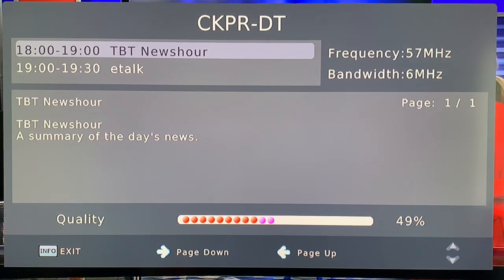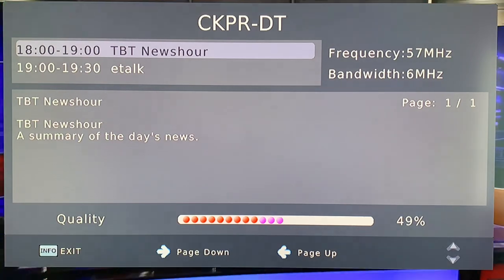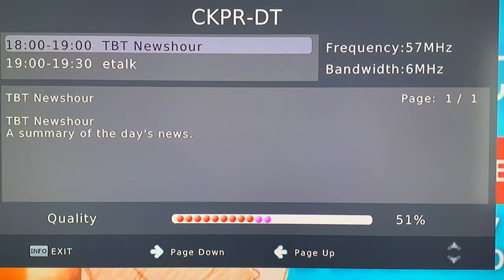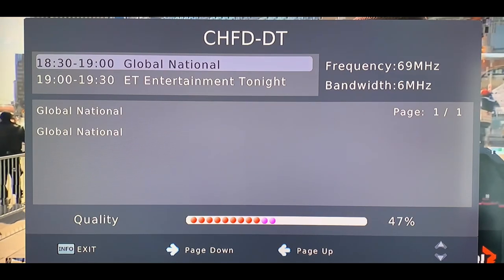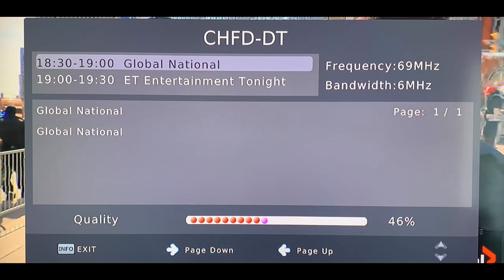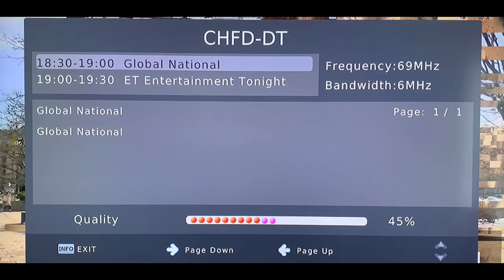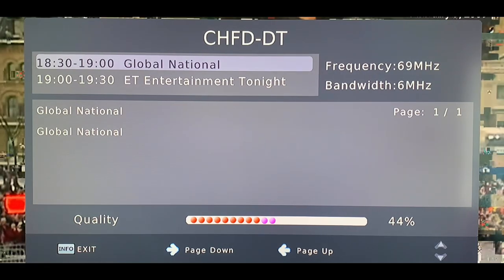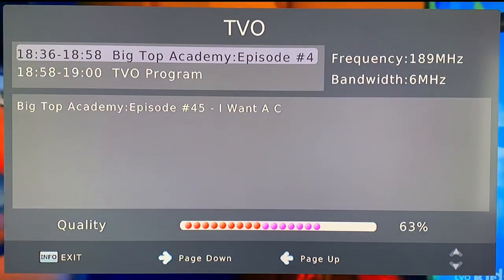RF channel 2 is actually doing pretty well with a smaller indoor antenna like this — the picture is stable, no glitching, no pixelation, and it's hovering right around 50, which is really good for VHF channel 2. Channel 4, though, this is definitely not a sweet spot — it's a glitchy channel and really tough to pick up inside reliably unless you're using a larger antenna. Even though the signal strength is in the mid-to-high 40s, there's a lot of pixelation. The real winner here is RF channel 9.